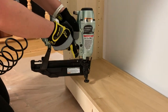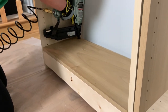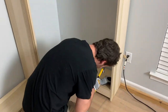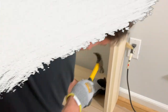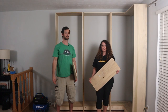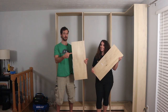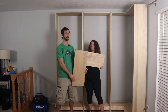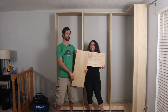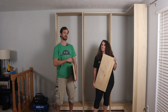Now that we're happy with the sides and placement, we add a few more nails on the bottom shelf for added stability across the entire unit, and tap in any nail heads that aren't already flush. We have made our frames, and soon they shall be attached together. We are making shelves — some straight, some corner-style — and then we're going to add some facings and moldings to embellish it.